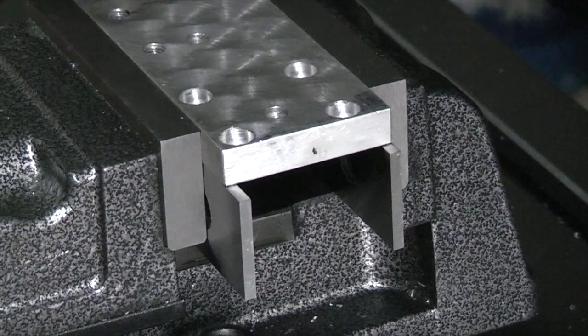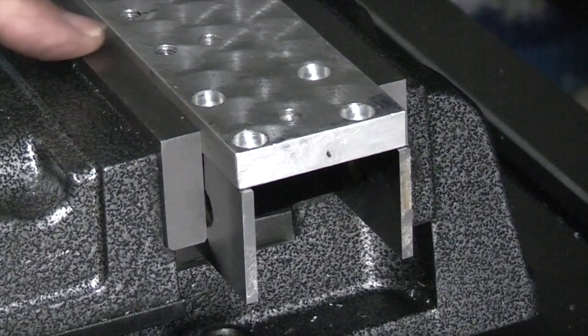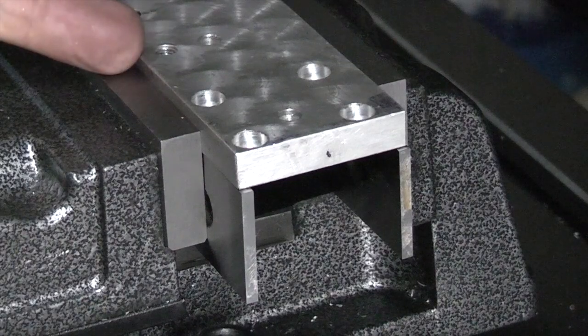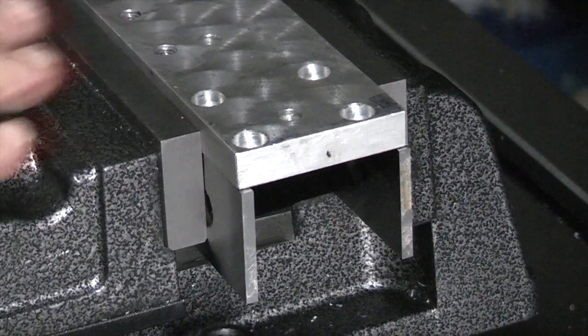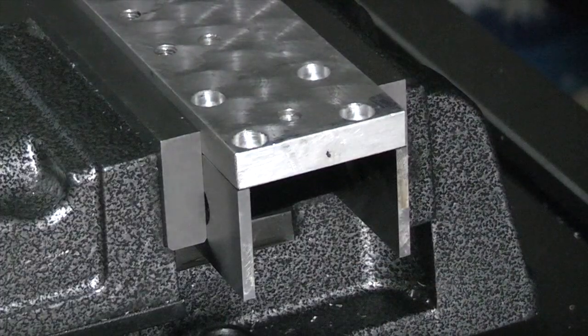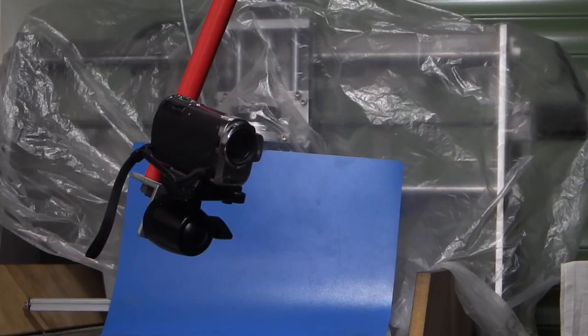But not enough to be able to mill across the front, the top of the vise. I've changed them for the next one up. Now you can see I've got another eighth of an inch higher, so I've got plenty of material above the top of the vise. They're parallel with the bottom of the vise. I can tighten the jaws up now and use that to mill. That's a parallel strip set — they're ground all over, even the ends. I'll find them useful. Well, that's the tool review over.